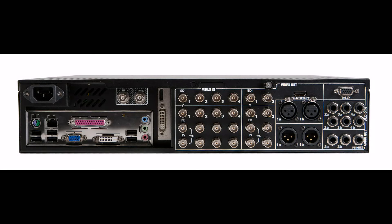Next we have our audio input — there are four stereo pairs of audio input, both XLR and quarter inch jacks. You can also bring audio in as an embedded audio signal on the SDI video signal. There are also audio outputs: you have one A and B, and two A and B, as well as a headphone jack. You also have the ability to output audio via embedded SDI audio.